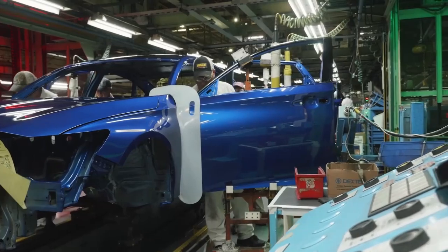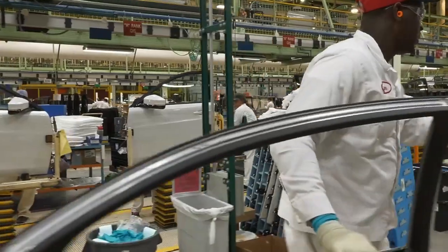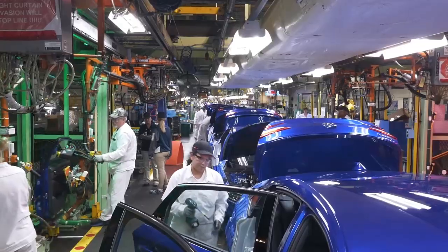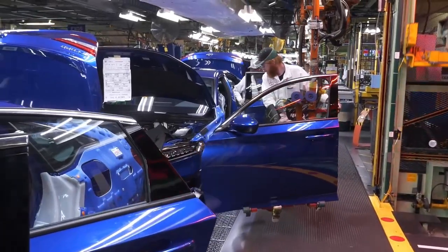This is the last step for the new Honda Accord. These units go through the paint area, they paint the doors, then they remove them from drop lift. Drop lift sends the doors down the door line where they assemble the doors. They install the liners, the door handles, the mirrors, the chrome. And this is where we install all four doors for the new Honda Accord unit.